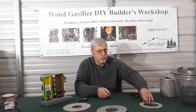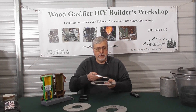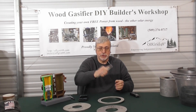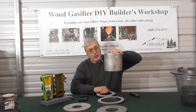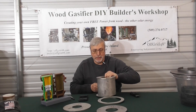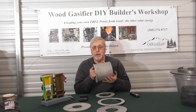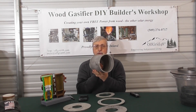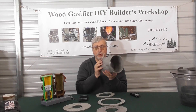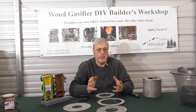What we did is we took the original choke plate and broke it into two pieces — we made an outer ring and an inner ring. The outer ring sits in there, and the inner ring becomes the choke plate that we weld onto the reduction tube. The reduction tube is also stainless steel, schedule 40 quarter inch thickness. You can take whatever size choke plate you want and weld that to a dedicated reduction tube. We have very little clearance on the outside so we do the welding on the inside with skip welds to secure the reduction tube to the choke plate, and that still allows us to remove the choke plate even with the hearth liner and diverters in place.